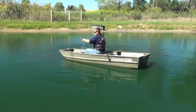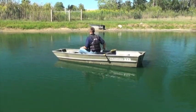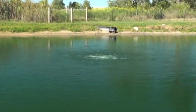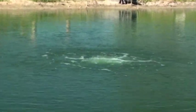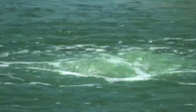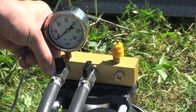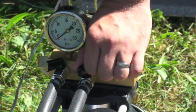With the system running, you can easily guide the diffuser into place. Once you are comfortable with the diffuser placement, release one end of the nylon rope, pulling the other end into the boat. If your diffuser is sitting correctly, there should be no friction when you pull the rope. Repeat these steps until all diffuser plates are in position. If you have multiple diffusers, you may see a difference in the amount of bubbles — the diffuser in the deepest water or with the longest run may require more pressure. Adjust the valves for maximum performance and wait several minutes to see results.